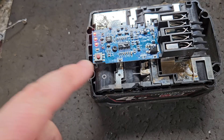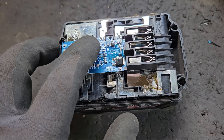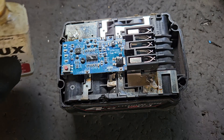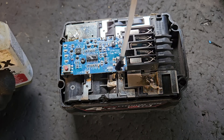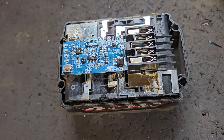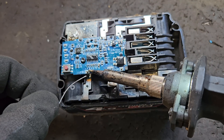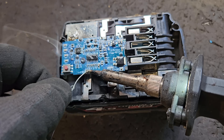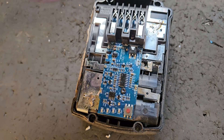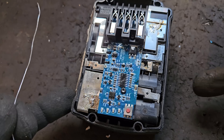And we can see it's actually showing three bars already. So we've got to just solder these four points now — one, two, three, four — and they'll be good to go. I'm going to flux them up again just to make sure. I'm using flux core solder for the most part for the bigger stuff, but I use this finer stuff for these small little points. That doesn't take much — only a little dab — just apply the heat down to it and that's it.